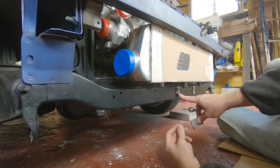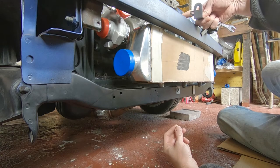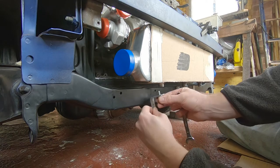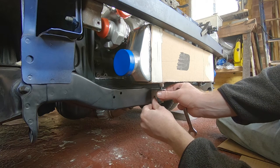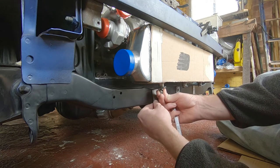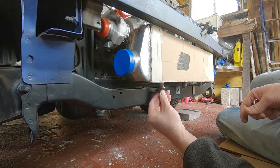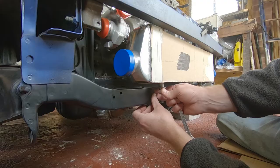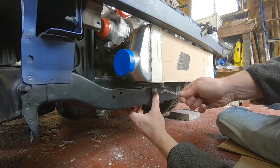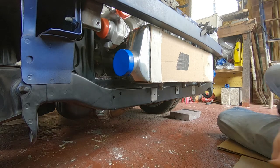This is the last one to go on — the center one is on the original M6 nut already in there from the factory that holds the bonnet catch brace, so we're going to have to replace that. These posts on the intercooler are 15mm deep, so with a 16mm bolt we're taking out two mil for the bracket and two mil for the washer, leaving only about 12mm actually going in. If I could find the thread — there we go. Just nip these up; we've got one bolt at the bottom and one clamp at the top currently. These are going to act as our drill guide.